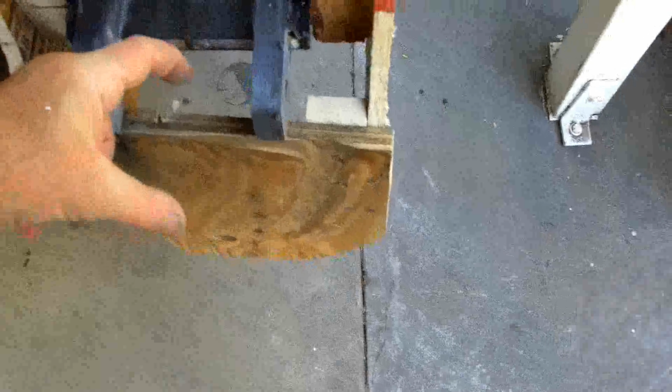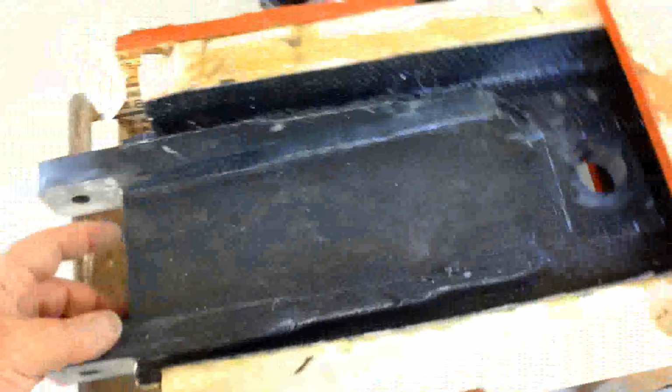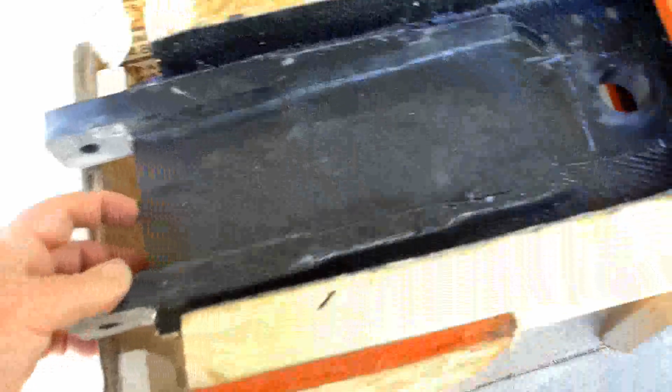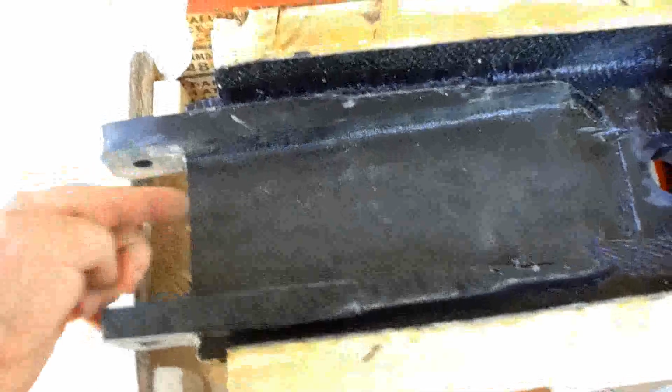What I'm going to do next to test this is I'm going to mount a pin in the end here, a long bolt, steel plate over the end, and then wrapped with carbon fiber, cut these off, and this pin will go into a receiving steel tube, and I'm going to jig this whole thing back up again so that I can load the test counterbalance spar up at the end to impart a shear load on this bolt that is representative of flight loads. And then I'll be testing this design of the bolt in the end, the steel plate, and the pivot tube.